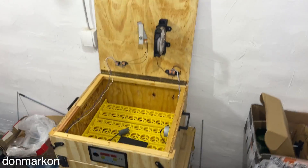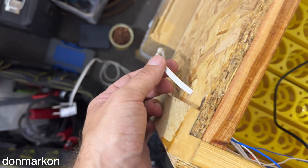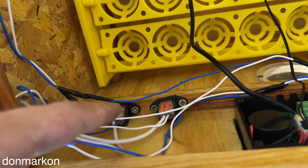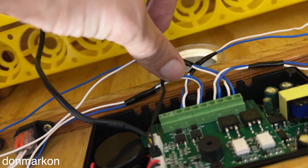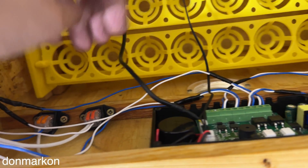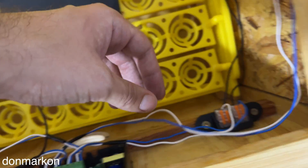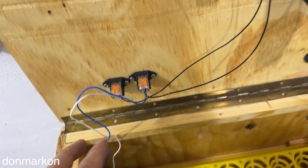Okay, this is the finished wiring and I'm going to explain everything. We first have 220 volts incoming here and we have two Wago connectors mounted. I connected them with the mains input which is this middle wire, so it is going here and connected to these two. So basically if something happens with the controller you can easily disconnect this and just pull it out. It is the same for the motor — we have a motor here which is connected to two Wago connectors and two wires which are connected to the controller. It is the same for the heating element.